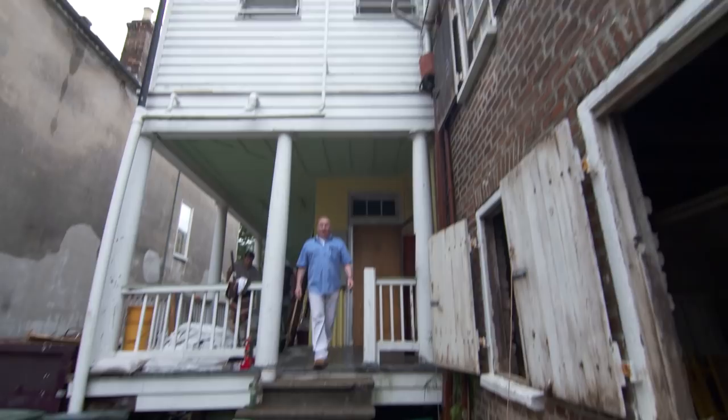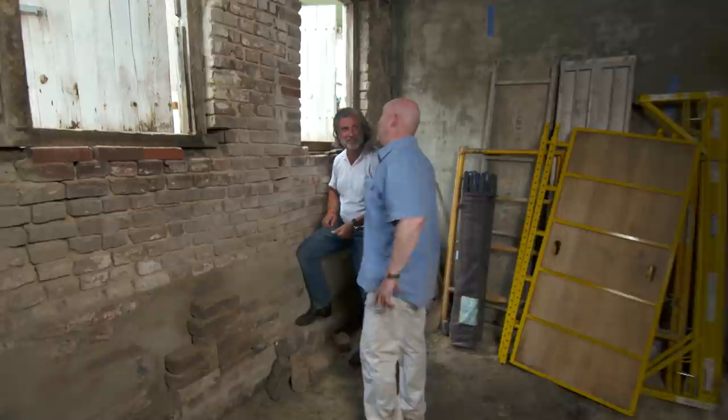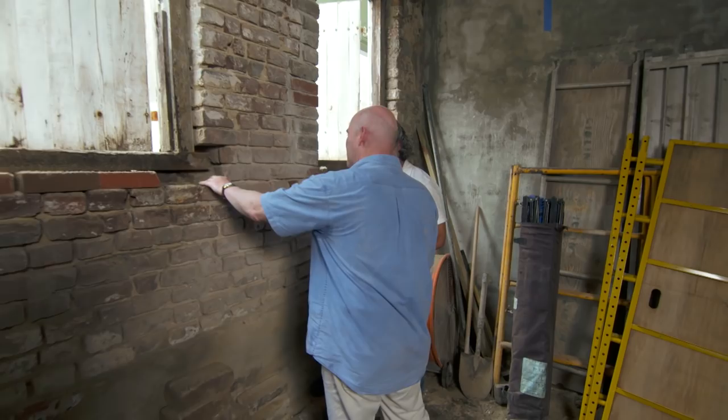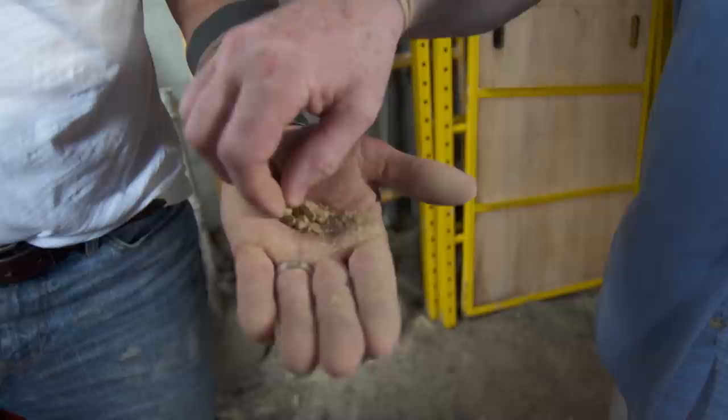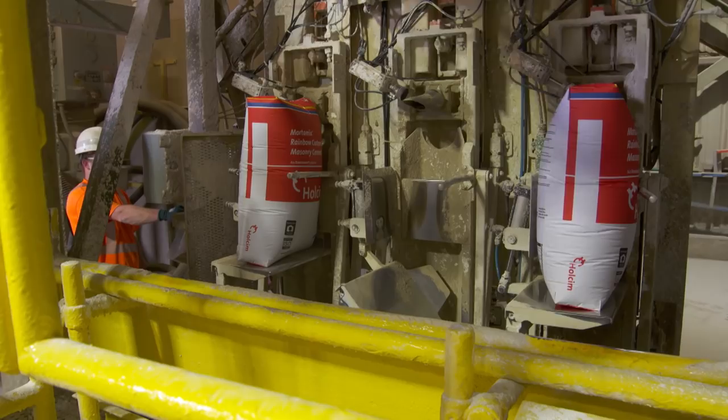Last week, Mark and Tommy found a lot of damage right here in this kitchen house with the mortar. I'm here to check it out and see what we're going to do to fix it. Mark, looks like a complicated mess. I know this mortar is about 150 years old. Up in Boston, we make sure everything's compatible — all materials. What do you guys do down here? It's a very common problem in this historic city. But we're fortunate — I've got a place right up the street. I take a sample like this and send it up. They'll give me a report on the color match and material composition, formulate it for me, and send it down in a bag. I've got to see that place.